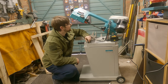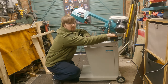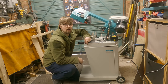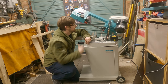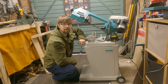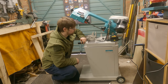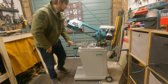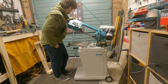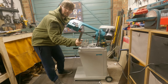The only thing it did mess up on right at the end is it cut out too early — it hadn't quite finished the cut. Just down here you've got a cut-out switch, and that switch has a plate above it which you can adjust up and down to control when the blade cuts out. I had to quickly adjust that and recut it, but that's not the end of the world really.